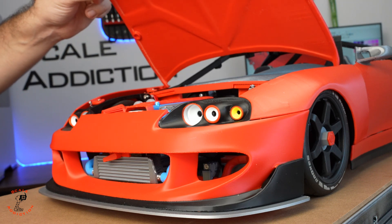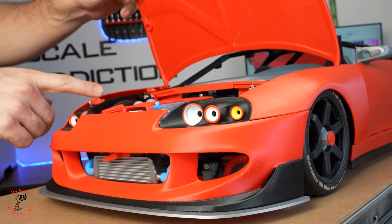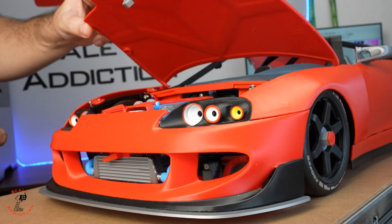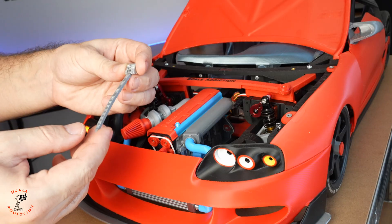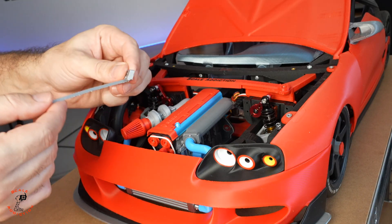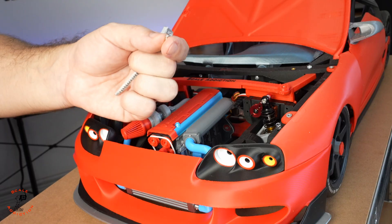Now it's working the way I expected — it pops up and you don't have to think about whether the latch has returned to the same place. This idea came out really good. Now we're going to design a hood rod and make it print-in-place so you don't have to assemble it — just screw it here and it will hold the hood. I did a few tries until I got it right since it was gluing together being printed in one piece. I'm using an M1.2 by 4mm screw.